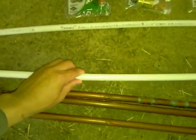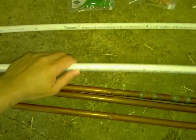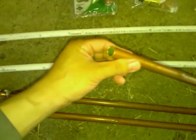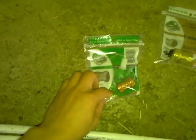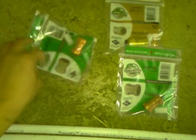So I'm going to be replacing it with this half inch PEX piping. I've never worked with plastic piping before, so this will be my first time. This is half inch piping and this is also half inch inside diameter copper piping. I've got a few couplings that I'm going to be using because there's existing copper piping in the attic, so I'm going to have to join the plastic piping to the existing copper. I'm going to use these half inch couplings from Gatorbite — I've used these products before and had good results. Here's another adapter and another half inch coupling. Should be pretty smooth and quick.